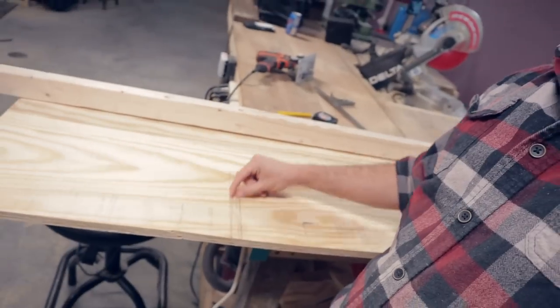Now what we need to do is take this big long brace piece. There's gonna be 6 of them right over there, and those are gonna make the internal structure. And they're gonna be these half lap joints. So I need to cut out 8-inch notches on either side of them, like what I have drawn here. I'm gonna be cutting out these notches, and then they're gonna slide together, and then I'm gonna join them with some angle brackets. So we're gonna make those cuts, and then we're gonna start assembling everything together. Cool?